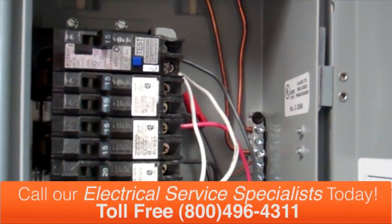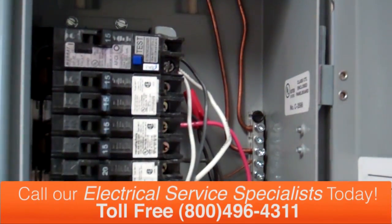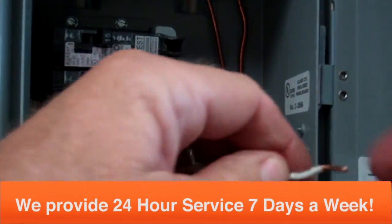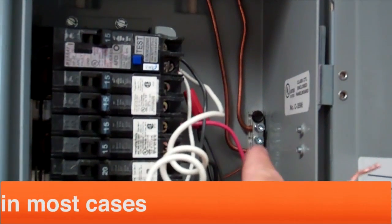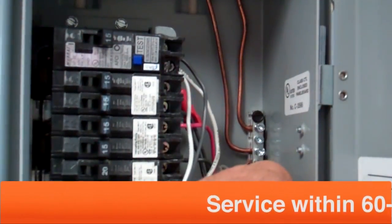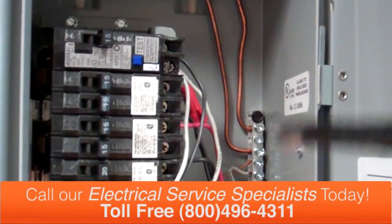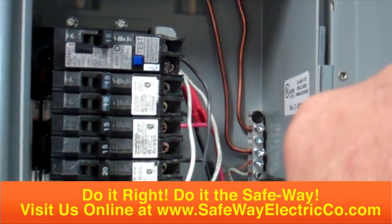The white factory-attached neutral wire — we want to go ahead and put it underneath the neutral terminal strip of the circuit breaker box. Find an area that's open where you can put a screw. You don't want to double-tap any of the screws by putting two wires under one screw, so be sure to find a screw that has an open spot. Always act as if there is electricity in here and stay away from anything that could have voltage on it — that's just good workmanship, good practice. Securely tighten the factory-installed neutral off the arc fault circuit breaker underneath the terminal strip and properly tighten it down.